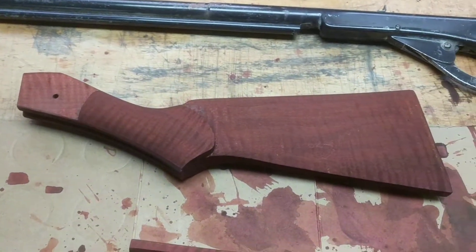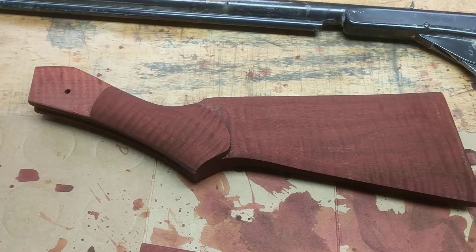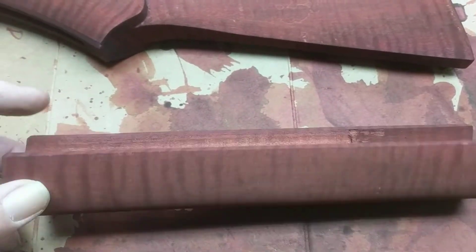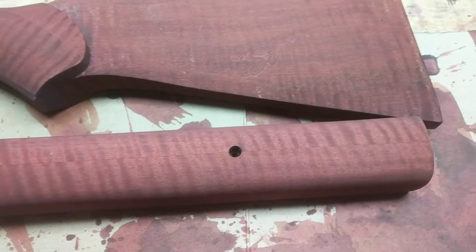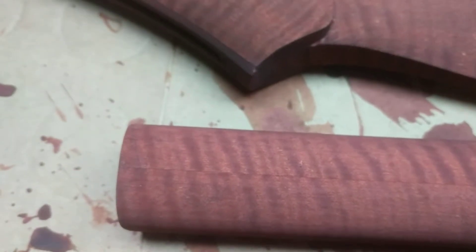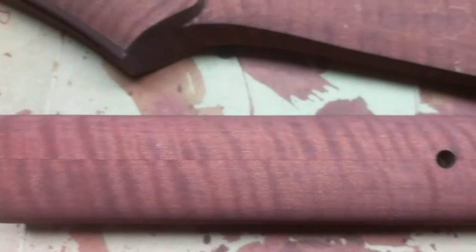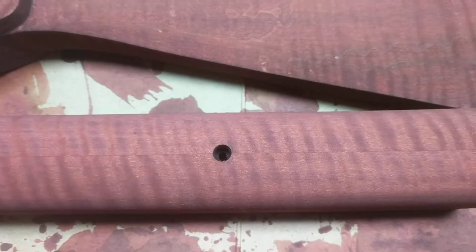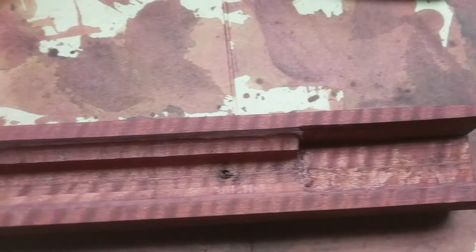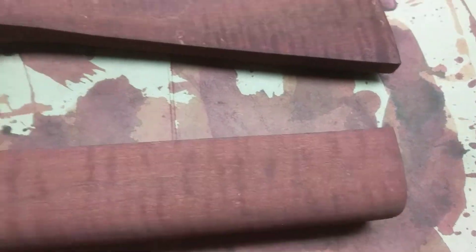This one is cut a bit longer — it's about a 15 and a half inch length of pull once it's installed on the weapon. Took the original forearm and did a fat bob curly maple glue-up. This is a more traditional build technique for me. I'll take two pieces of four-quarter curly maple planks, glue them up, put them together, route them, profile them, cut them, and mod them so that they'll fit the gun adequately.